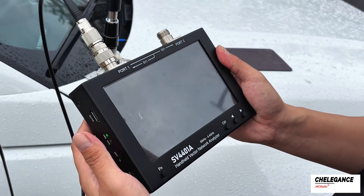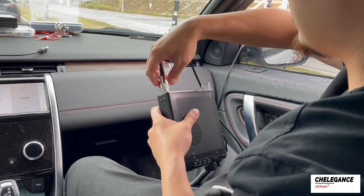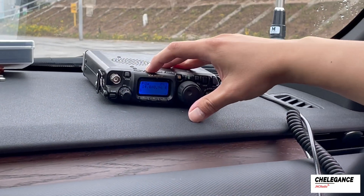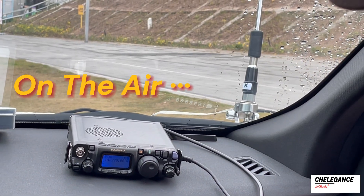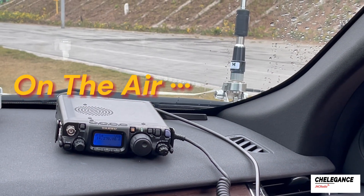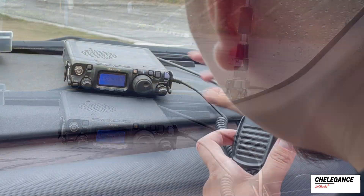Okay, the frequency has risen and is now in the operable range, at which point we can operate with the radio. So now we'll hook up our antenna to the FT818 radio. Let's tune to SSB mode and tune to 14.270 megahertz and see what kind of signal we can receive. We can hear that the reception is good.